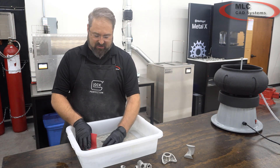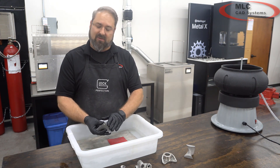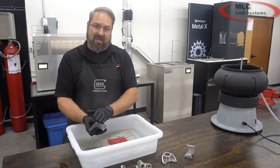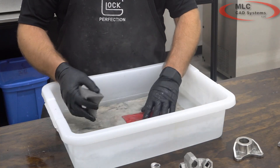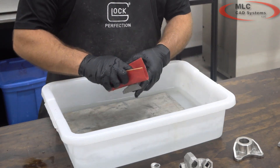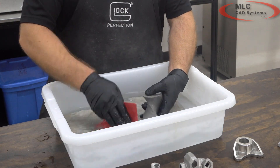We're going to take our part and make sure it's nice and wet. On the bottom side, I like to put a flat plate inside my water bin, because for any flat surface it's really easy to just set it on there and wipe it around a couple of times. You'll see it begin to knock down those layer lines, and you're getting an even contact surface when you push it down on the flat plate. You'll begin to see some metal particles in the water — that's exactly what we want to see. We don't want to see those all over the table. We're just lightly going around the part, making sure we're washing both the paper and the part very often.